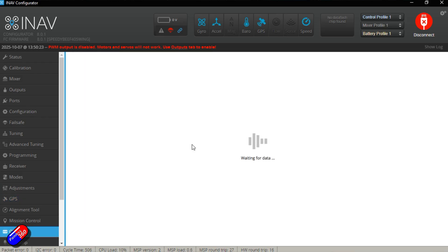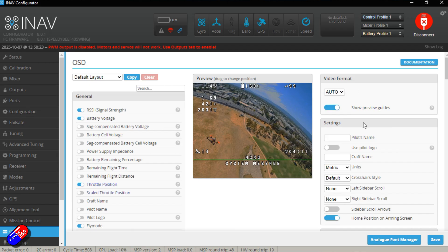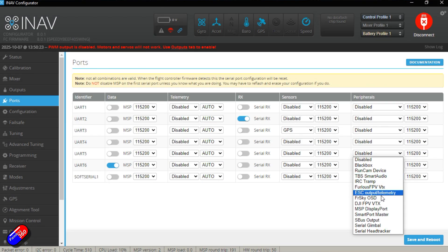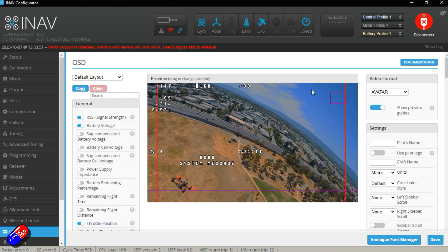Last couple of things: the on-screen display tab by default will be for an analog system. Don't forget when flashing with iNav to reload the analog font manager and go flash the fonts onto the flight controller — it doesn't use that if it's going to be something else. By default it's not going to give you any of the options for an HD FPV system — we're going to have to set that up in the ports. If we go back into ports and look at the outputs, we can see that UART5 is for that stuff. So we set UART5 for MSP DisplayPort, click save and reboot, and now when we go into the on-screen display tab we're going to have the options for all the HD stuff. It'll default to HD0 but I can quickly change that to DJI or Avatar. If I select Avatar, I have the option to drag around all the different pieces to where I want, and the red and purple lines show me where to avoid so things won't be off-screen.